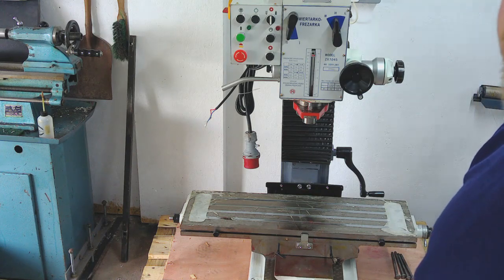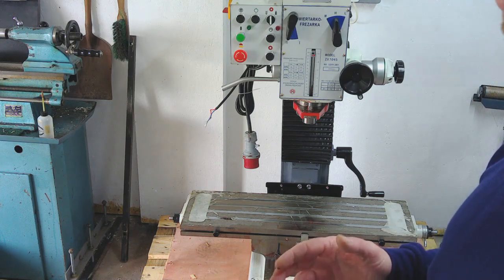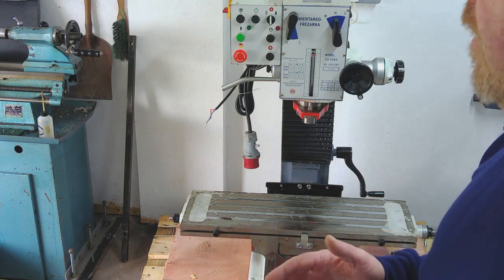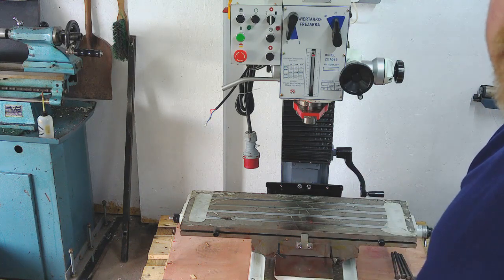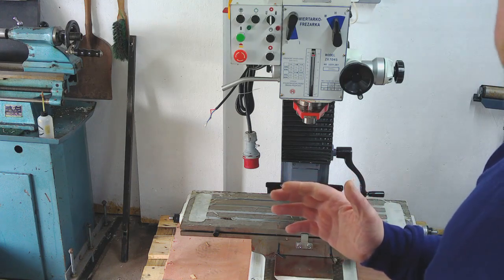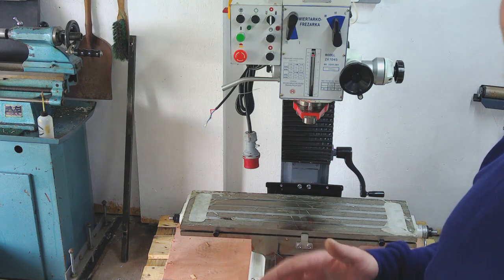I think this is going to work, I'm not entirely sure. And what it'll do, it'll provide a first real, what I should call, decent project to do in here for the lathe, to make a drawbar to suit the mill so that I can get M16 Morse taper 4 stuff. So it will be right on the capacity of my lathe. It's going to need me to put the travelling steady up and things like that to do it. So it will make a decent project.